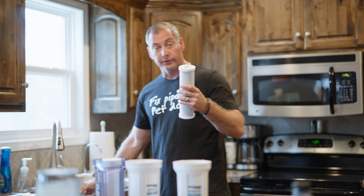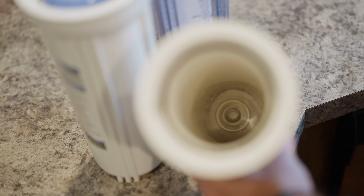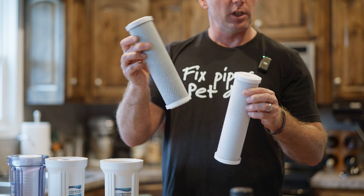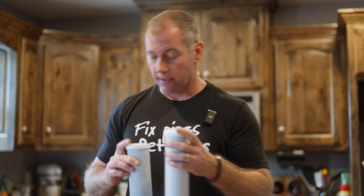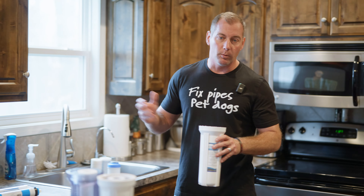This one is going to be your carbon filter. You can see the carbon start to migrate through the coloration — it's like a charcoal filter. If you look into the bottom of that assembly you can see carbon down there. After it gets wet you see it permeate through. It's not dirty — it's dark because it's a black carbon filter inside and it's just wet. Some water softeners have an automatic backwashing carbon filter built in, and when installed new a little carbon can get loose and make your water gray for the first few gallons — totally normal.